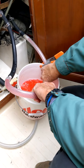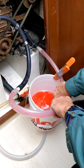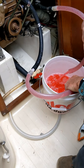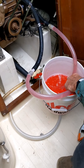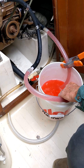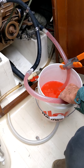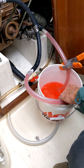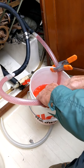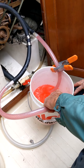The thing that's coming out here is coming out — circulating the antifreeze. I'd leave it like that for a bit. You're unlikely to see it coming out of your exhaust because the engine's going to be fairly cool. I forgot to open up the through-hull once when I started it up — it heated up pretty damn quickly down there. Keep an eye on the temperature just in case. Let's put a little more antifreeze in there.